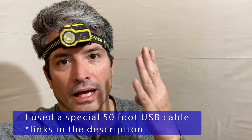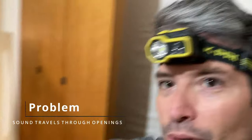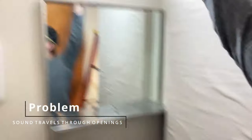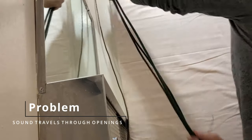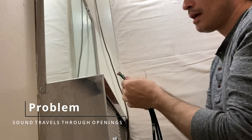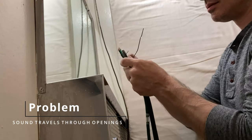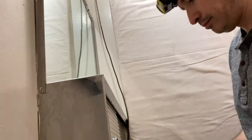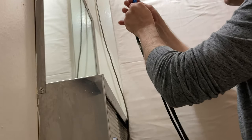So that's how we made the door seal off the sound, but it can still be opened and closed at will. In order to get things connected in the booth, I need to get power, data, USB, and two mic cables — in and out. So instead of using the door entrance and putting a hole through it, which will compromise the sound more, I'm gonna put a hole right up there — drill through the ceiling and wire everything through there. I tried to do it a different way, but it was hard to get it through that hole. So I'm gonna create this little bundle so they all fit as one unit and I can get it through just enough to stick out and then pull it through.